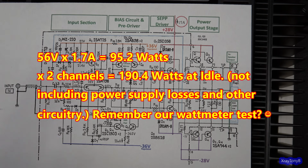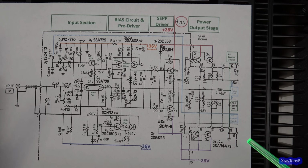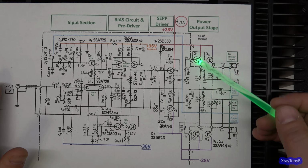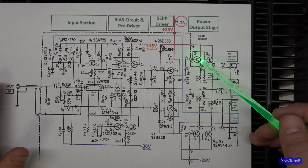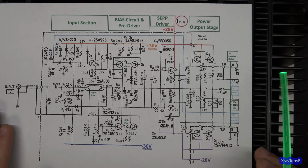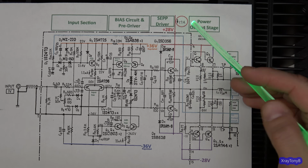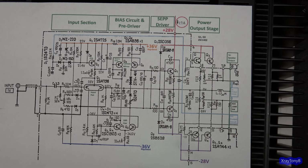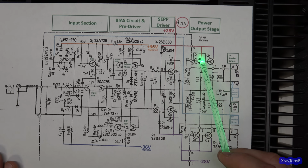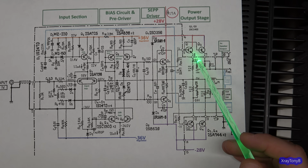And then what's happening is, if you look at the service manual, they're telling you that they want about 800, 850 or 820 milliamps of current flowing through one of these resistors here. And if you notice, there's two of them paralleled up. So parallel circuit, you have a current divider here. If you add those two 850 milliamp currents, you come to a total of 1.7 amps. And so there's a minimal amount of current here, almost none. It's very, very low because you're just driving the base of this. But most of the current is up here. And that is the reason it is in Class A.